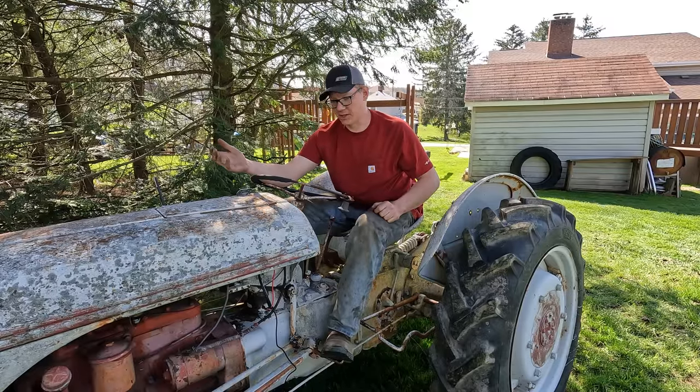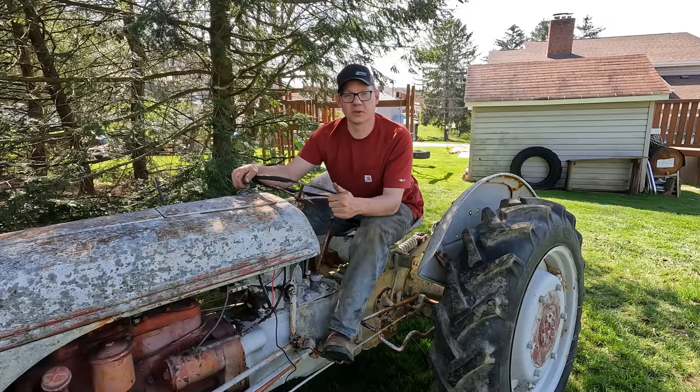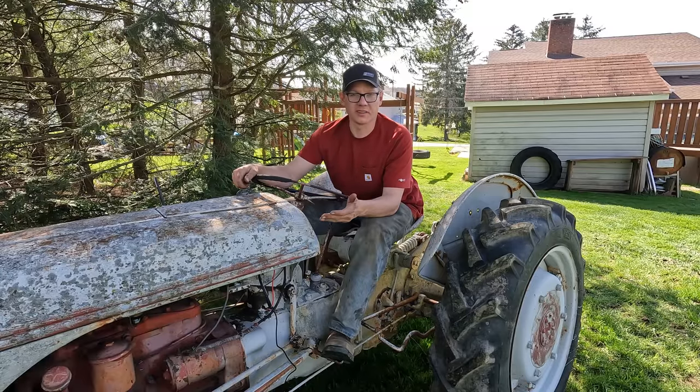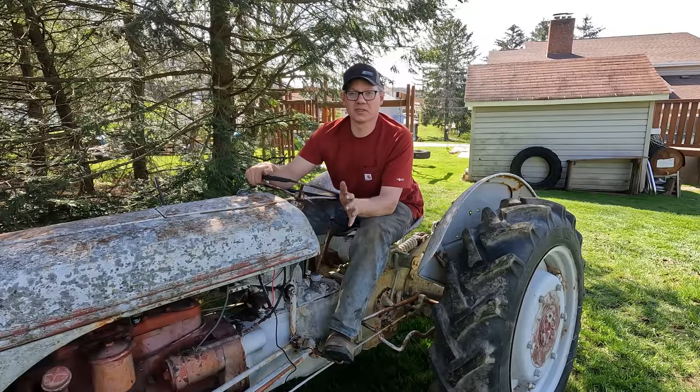There's good oil pressure. It does still smell like antifreeze just a little bit as I'm sitting here, but I did notice that the radiator is completely plugged full. So a little bit of time with an air compressor or a pressure washer, probably get this thing cooled down immensely, and maybe it wouldn't smell like antifreeze. I don't know. Still needs to be some investigating done there, but I don't have the time to dedicate to this thing.